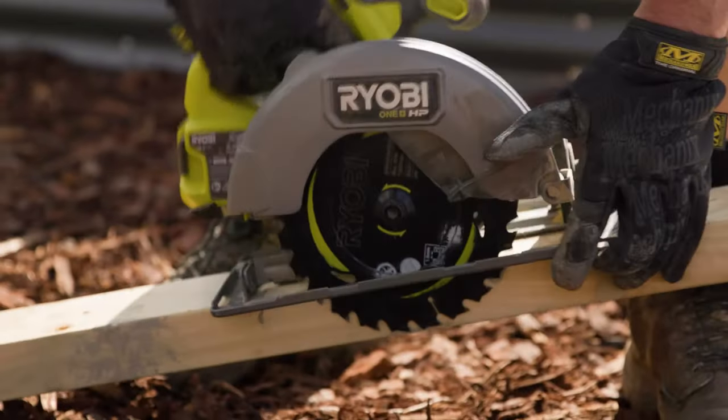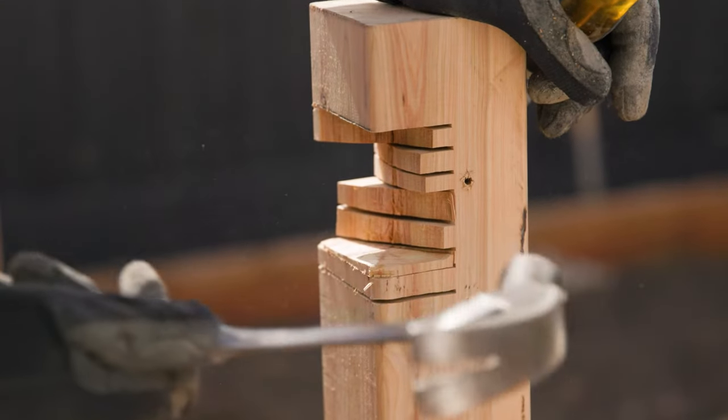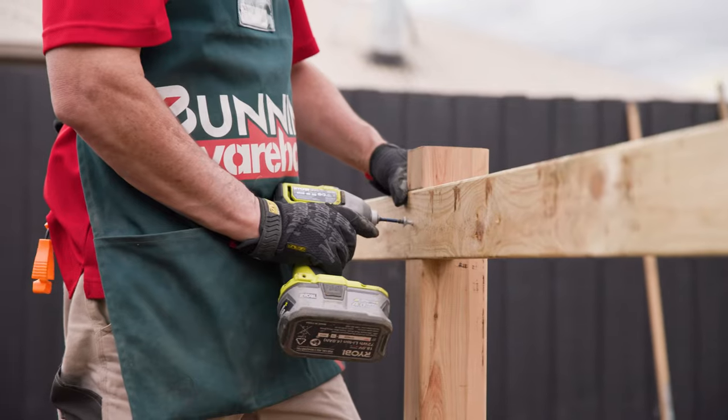To check out, you'll need to set your saw to the depth of your rails, doing multiple cuts small enough to knock out with your hammer. Then use your chisels to tidy up the check. Once you've cut your rails to size, screw in.